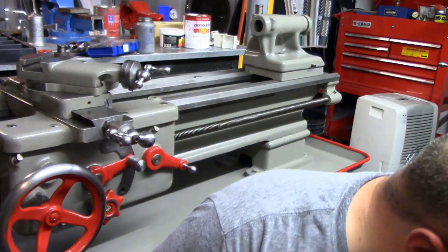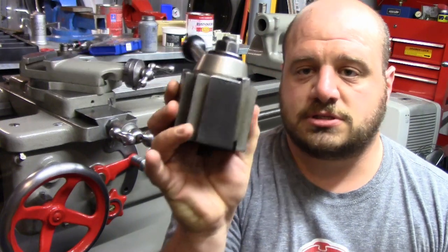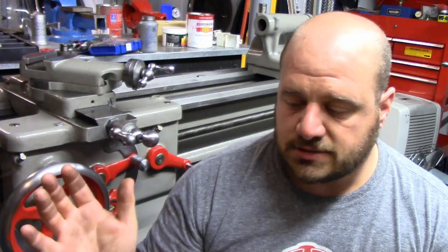So there is still some work to do on this. I do need to strip and paint the covers, and I also need to remake the shaft for the sliding gear. I want to remake the cross-feed screw and nut. I have to make a back plate for the four-jaw chuck that's going to live on this. This lathe originally came with an Aloris AXA tool post - we're going to be getting rid of that. I have an Aloris BXA tool post, so I have to machine the T-nut for that. I also want to remake the screw for the tailstock, which luckily is the same pitch as the cross-feed screw. We're going to be remaking that and doing some modifications to the barrel to replace the threads in there. The next few videos are probably going to be getting this all dialed in and leveled - I need to also either make or buy some leveling feet. As far as assembly videos, we're pretty much done with those.